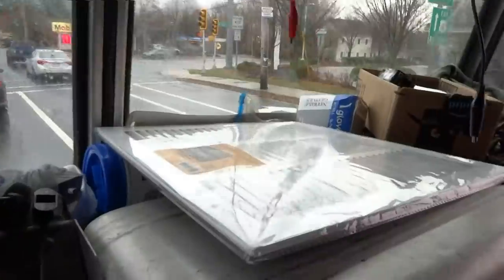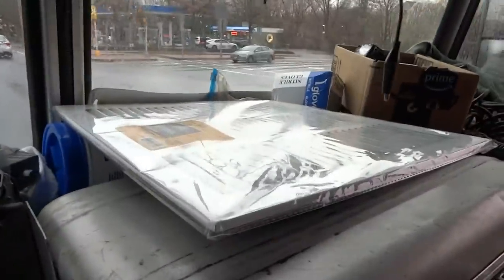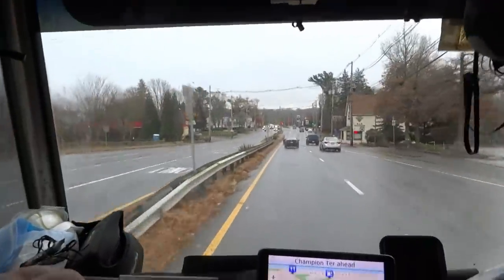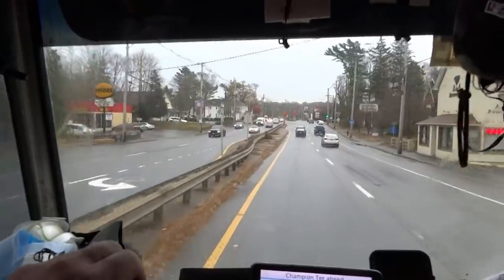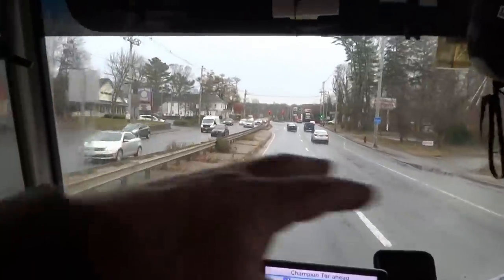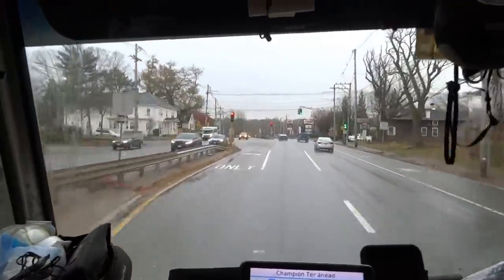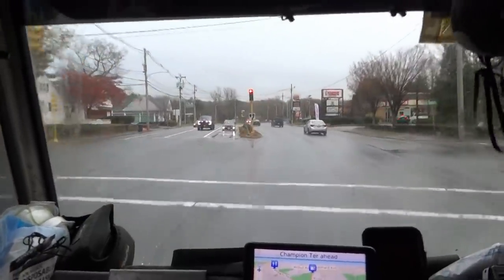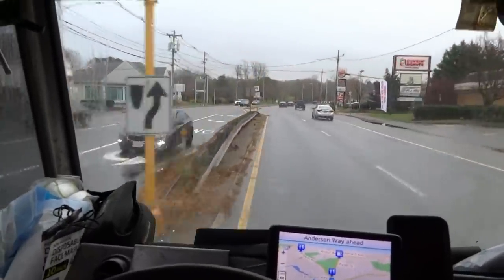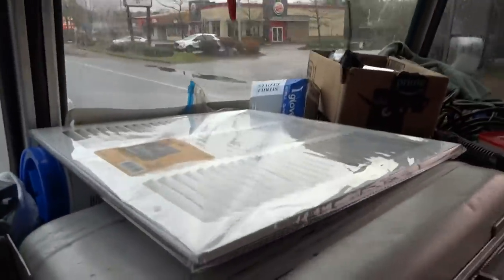I got a vent here, he's got an access port where he works on the gas valve and lights it. Well, I'm gonna put that access port there for makeup air. What they did was later on after they built the house, they come and finished off the cellar and boxed it in. You gotta have makeup air here. It didn't soot up or nothing, so it's got enough air from around the doors and whatnot. I think he's got a couple of sections where he's got folding doors there. But we're gonna add that 14 by 14 grill also.